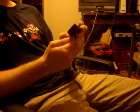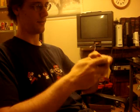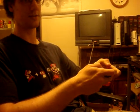Isn't that supposed to work in the first place? Yeah, well, it's one of those keychain sound effects. Oh, it wasn't real? Yeah, you press it and it made a punch sound effect. Press kick, it made a kick sound effect. And then if you did like a Hadouken, you'll do that, and supers. But I fucked it up, and I killed the PCB. And so I figured, well, this looks like it fits. So let me put it in, wire it up, and lo and behold, it does fit. And it does work as a PS3 controller. Wired, of course. There's a mini USB port in the back. But that's X, that's circle, so you can navigate through menus and stuff. And then you can assign them to different buttons in game. And if you click down on the joystick and click all the directions, it'll activate start. So that way you can play 2-player, get in the game.